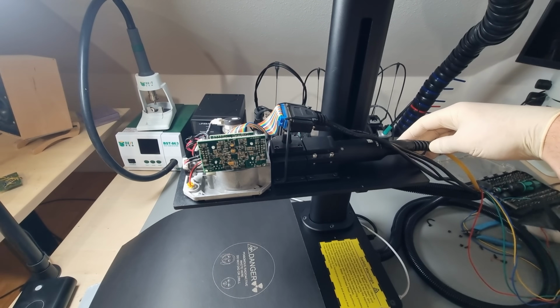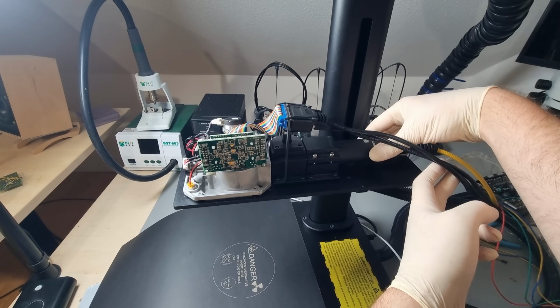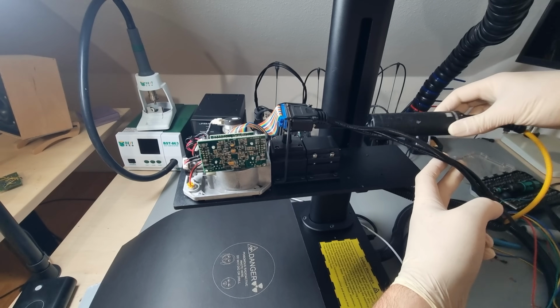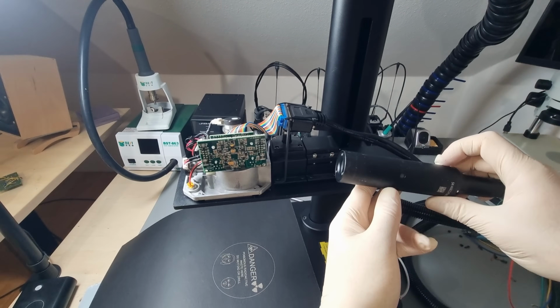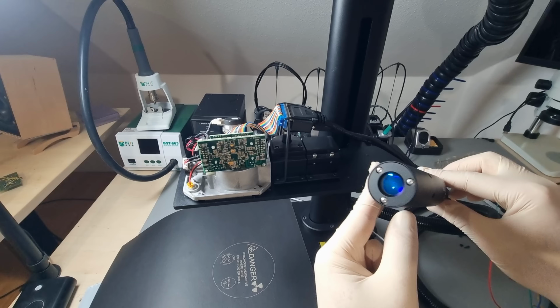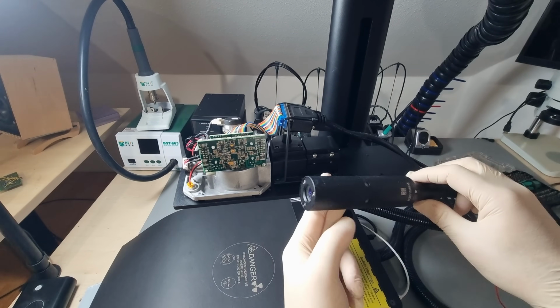Another important component in the head assembly, usually a part of the fiber laser source, is the output isolator, whose primary purpose is to prevent laser radiation from being reflected back into the source. But it usually also expands the beam a bit so that we don't engrave the Galvo mirrors, and stay clear of the damage threshold of the lenses.